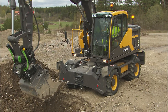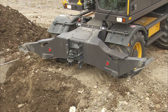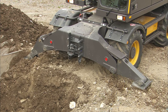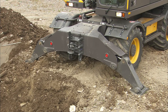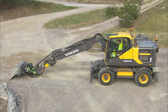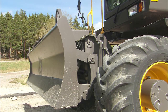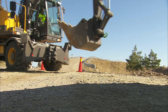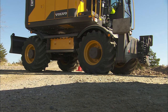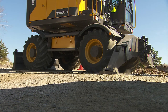For lifting and digging, use the outriggers to increase the stability of the machine. The operator can move the stabilizers and the blade independently to adjust the machine to an uneven surface. Each machine can vary depending on market and customer specification. If the machine is only equipped with a blade, there is no need to preset anything. If equipped with a blade and two outriggers or four outriggers, it is possible to choose and activate each function separately on the monitor of the machine.